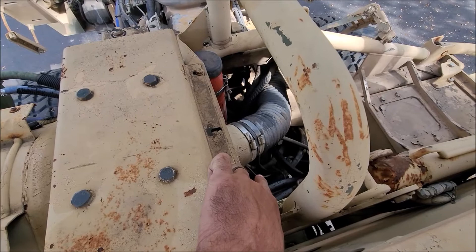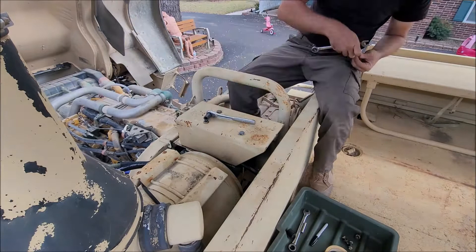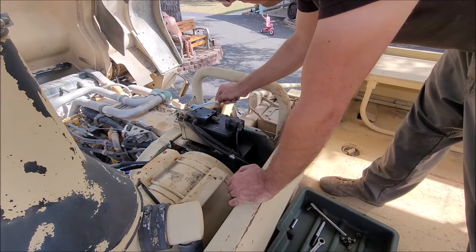You've got to start by taking the cover off — half inch. There are nuts at the bottom on this side; looks like one of mine is missing, and there are some half inch bolts under here. It's 9/16 for the airline and both hydraulic hoses — I'm going to take these and label them. Up here it's return and pressure.